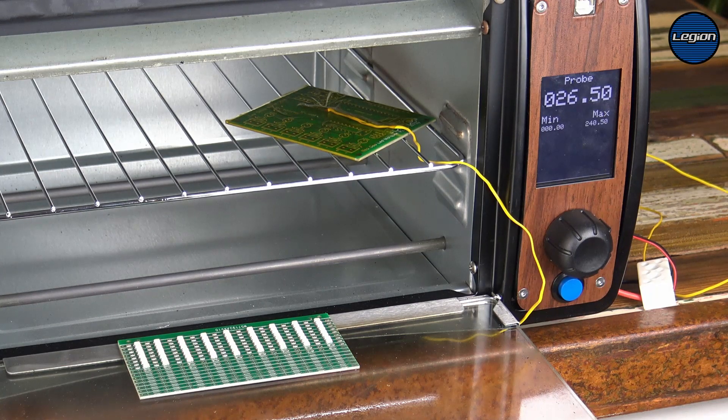The Mechanic paste seems to leave little bits of solder on the PCB. I know that I used a stencil this time, which probably made things a lot cleaner, but that looks really good. These are now going to be tested — I think I've got two of the LEDs rolling around so I need to fix those, and then these will be tested and assembled.